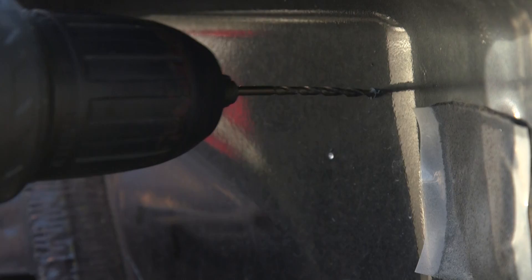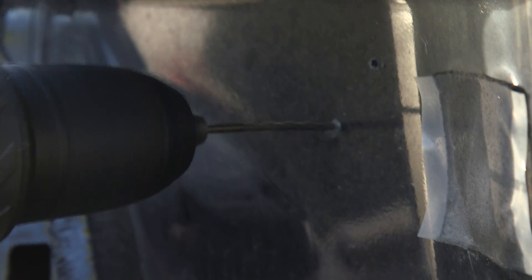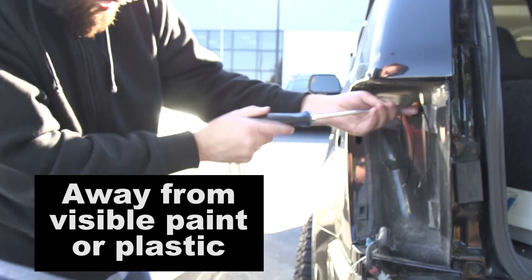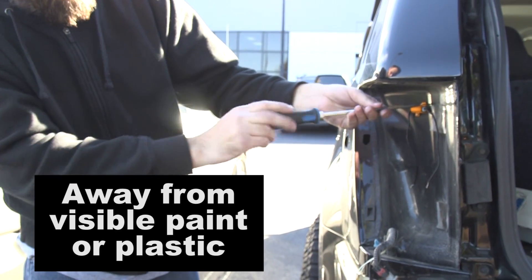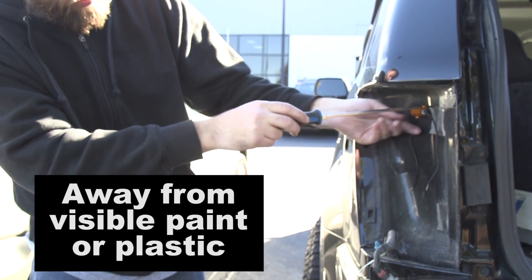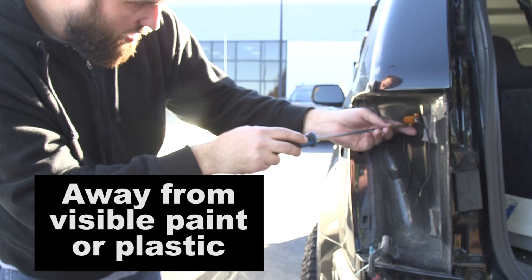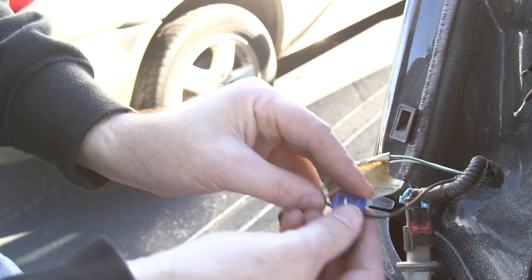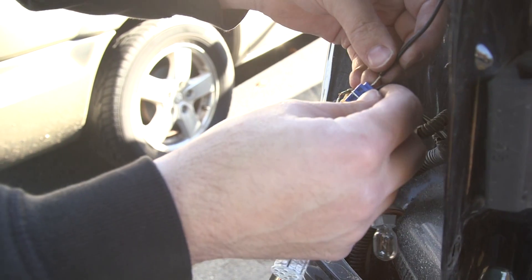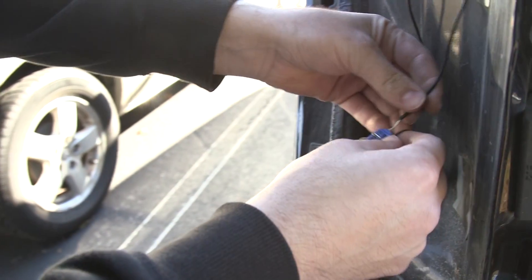Get it, reel it, and when you put a resistor in, always make sure it's mounted to something solid like metal, because any kind of plastics will melt. For this, it doesn't matter which end of the resistor you put in, as long as they make solid contact — that's all you're worried about.